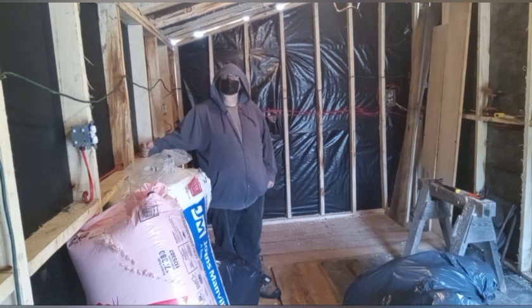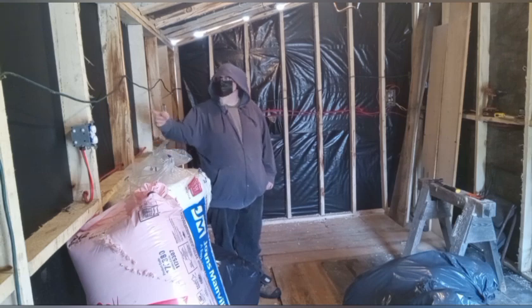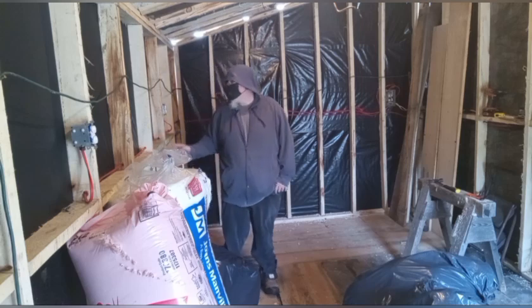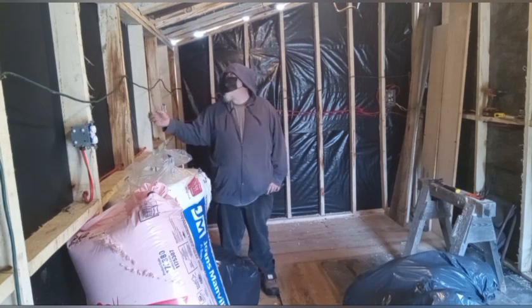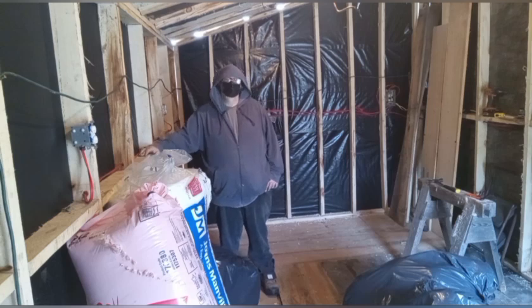And then this wall is going to be done with the 15-inch wide bats as well, but I'll cut them 23 inches long and run them lengthwise in the bay to fill it up. Actually, I cut the bottom side to compensate for that. Again, this was when the wall was first built, so I didn't have the ideal measurements.